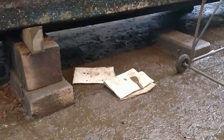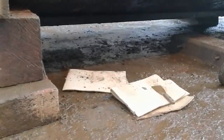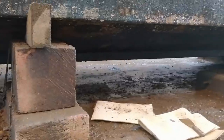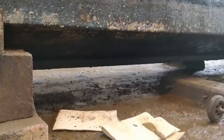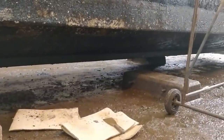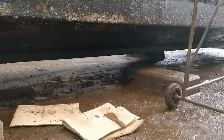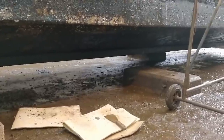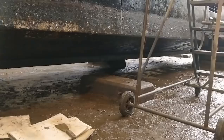We're now on the afternoon of the second day in the dry dock, and I'm having a lovely time scraping away under there. Because with it being a V-bottom boat, most of the bit that's actually under the water is funnily enough that V section. So although on a normal narrowboat you wouldn't generally black the bottom, this one basically does need it — so the only thing I can do is more or less lie on the floor and scrape away. Obviously the jet wash got a lot of the loose stuff off, so I'm just kind of scraping the scabs off, but it really is a fun way to spend an afternoon.